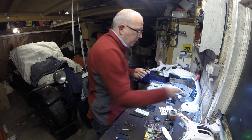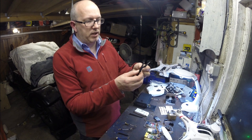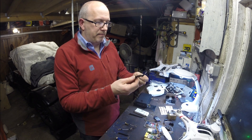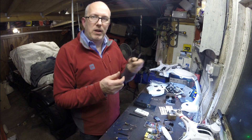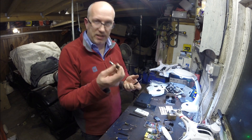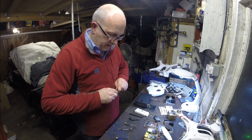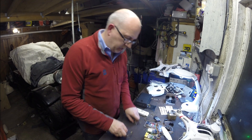It's actually quite handy — when I was first doing FPV on a little mini quad, I just stuffed a little antenna on top because it's much more difficult to break. And one of the things you can do is put it at 45 degrees already so that when you tip it over, it's upright. But there's limited success with this kind of thing. You're never going to get it to work as satisfactorily as with a circular polarised antenna. So chuck them away — use these.